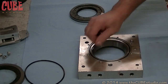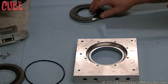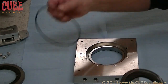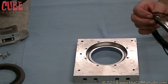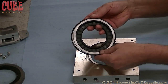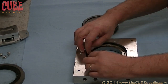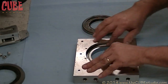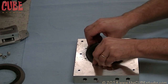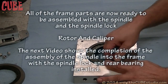That takes care of that side. On this other side we have a bearing retainer and another O-ring. The O-ring on this retainer is going to go in, but it's hard for it to stay on there, so we'll put it down in the groove first and then put the retainer on top. There we go — we're in there.